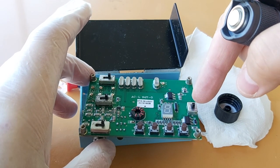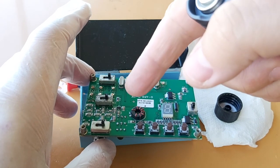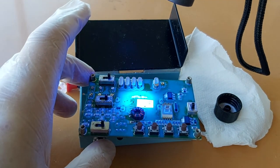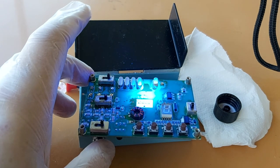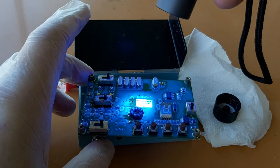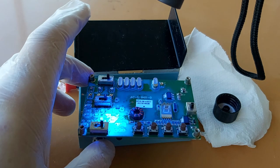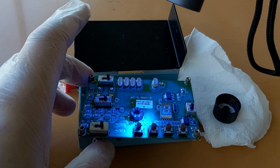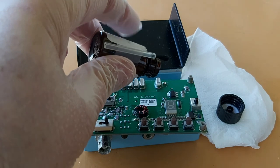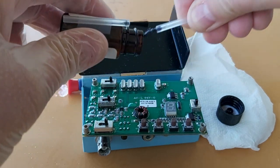The smell is just so bad. I got enough out of the last bottle to do the whole circuit board. Unfortunately I put some on the on/off switch so I left it in the on position, but that might be a problem — you have to be really careful not to put that stuff where you don't want it. Now I'm going to use the UV light, and it's actually showing me where the chemical is and where I missed — I missed a big rectangle here and an area next to the label. I'm adding a couple more drops to finish the job.